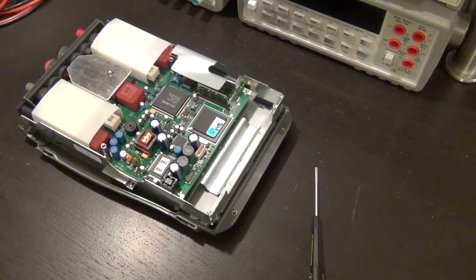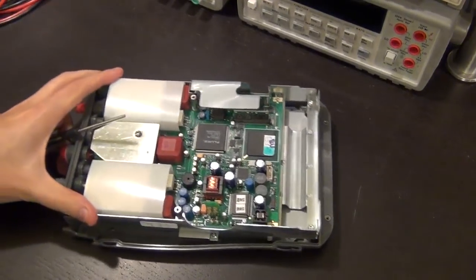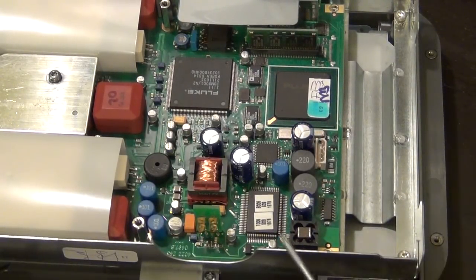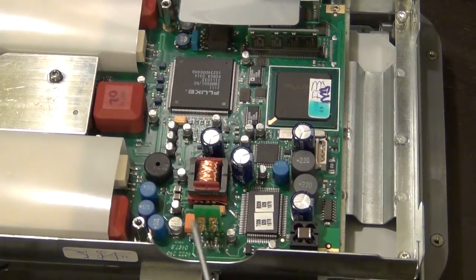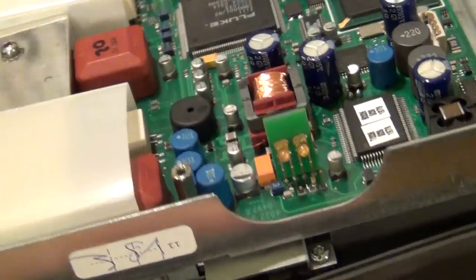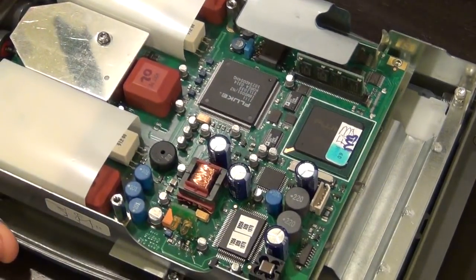So immediately I can see and recognize some of these components and what the possible function of each of them might be. This is the battery connector right here, and there is a filter here, which is a low-pass filter structure, with an inductor and a capacitor inside it. These two LEDs, I can tell immediately, are the infrared port of this unit, because you can connect it with an infrared connector, so that it can be fully sealed and communicate with the outside.